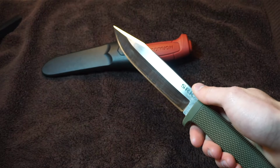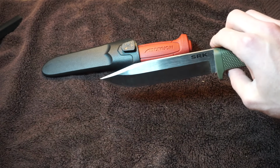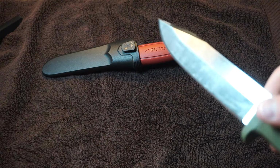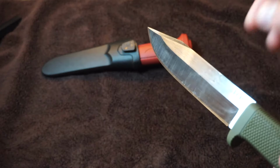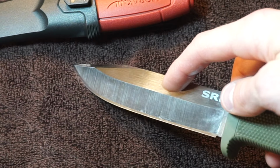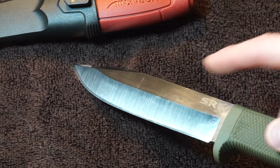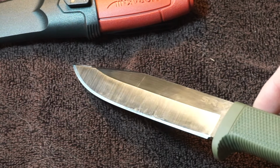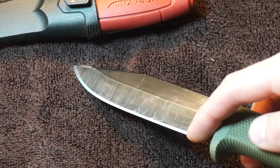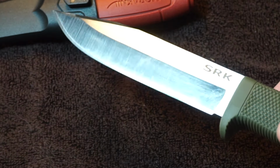So on a knife, you have the piece of steel. I'll use this knife as an example. There are a lot of different grinds used on knives, but let's just use this to visualize. This one has a saber grind. Here is the flat portion of the blade, and it starts tapering down. That's called a bevel. Now that'll go down until we get to a secondary bevel, and that is actually going to be the edge. That is the part that we sharpen.